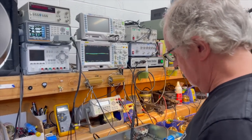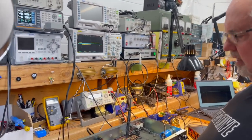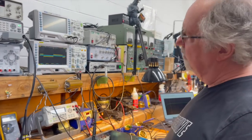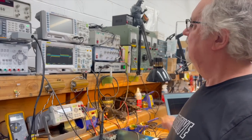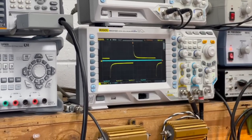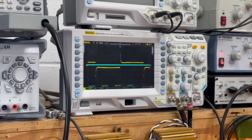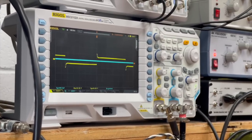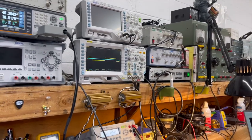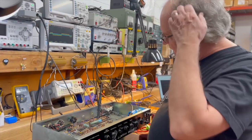And then also, that's the master. Okay, while we're here, I'm just going to look at the square wave response. And this is really interesting. We're taping this, so you can go back and look at this, either after the mod or when we look at Dave's amp. But this is a really aggressive high frequency. I was going to say forwardness. Is the presence jacked up? This is the presence at 12 o'clock, and it's still way up there. We have to turn the presence down to about 10 o'clock before we start attenuating it enough that you don't hear it. So I've never seen that before, even in the other ones that we looked at. This version of Hiwatt, that's a characteristic of it.